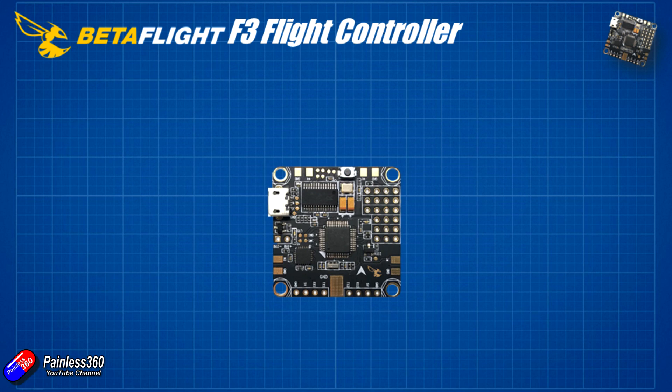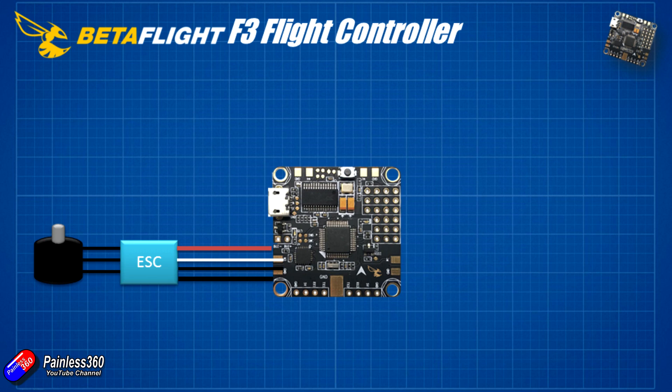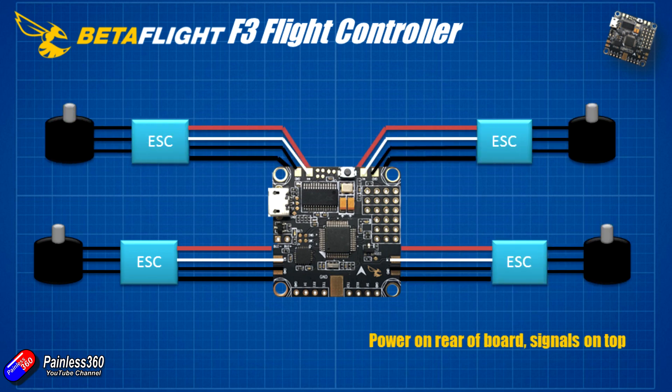Here's how we're going to wire up the ESCs and motors. Power connections go from each ESC to the back of the flight controller, and at the front we have ground and signal wires telling the ESC how much throttle we want. The other side of the ESC connects to the three wires from the motor. We won't worry too much about motor wire order — we can use BLHeli software to change motor direction if wired incorrectly. I'll mock up the frame in the next video to figure out cable lengths, then clip them, solder the ESCs and battery wires to the bottom of the flight controller, and install it.